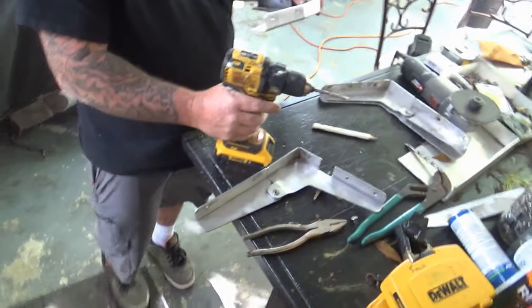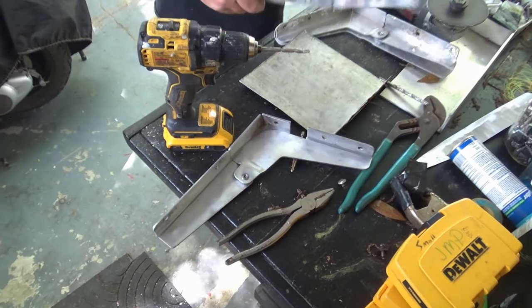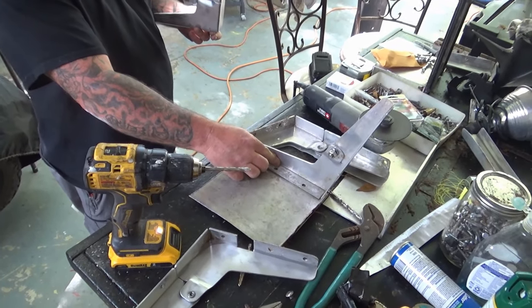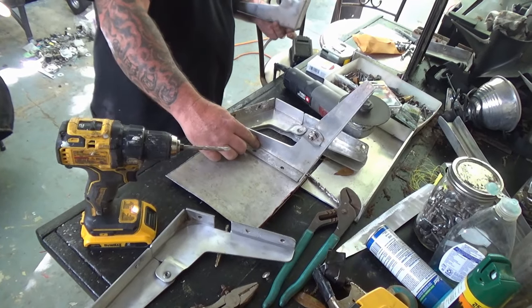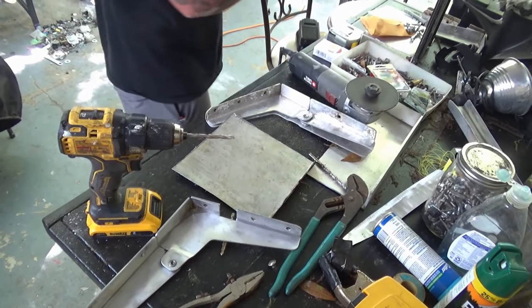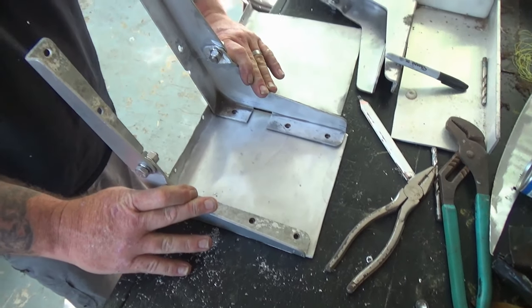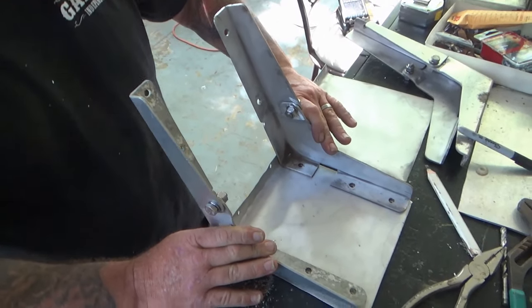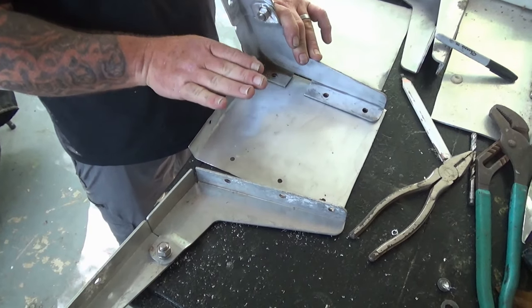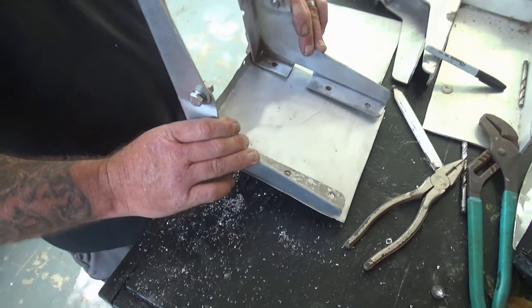We're in the process of building the trim tabs — the aluminum trim tabs — fabricating them with the master fabricator, Mr. Steven Gaines. I think that's going to work just fine. They're a little bit big, but we're going to test them out first and see what we need. We can always take it off; we can't put it back on. We're going to mount it to where it lines up with the bottom of the boat. It might end up with a slight overflow in the beginning of takeoff, but once it starts tabbing out, it ought to do its thing. Just make sure we seal this up good to the transom — bada boom, bada bing.